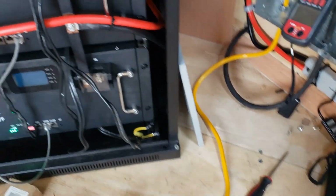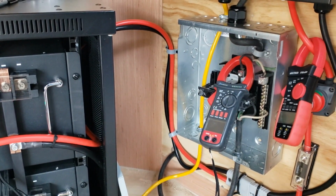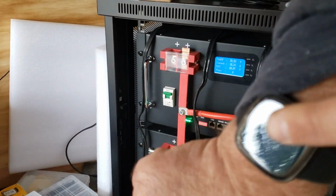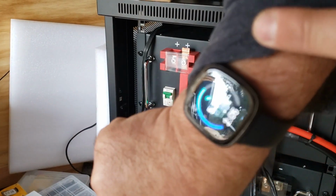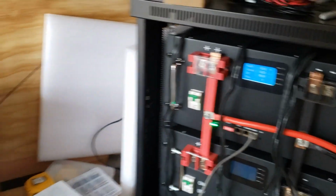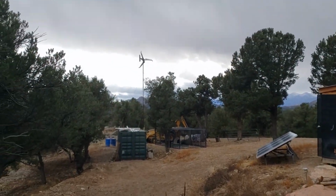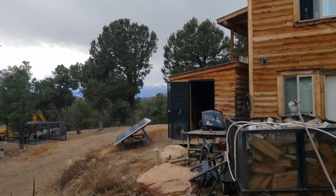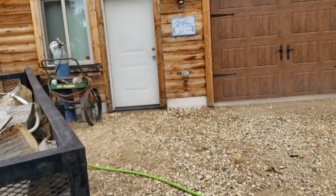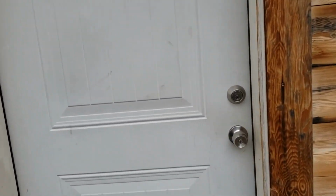Let's do a final temperature check. We're at like 1100 gallons. I just went and looked at the water, we're almost full. 58 degrees and it's 44 ambient. That's gotten up to 105 for a second. 93. The red one right here, the short one, I gotta check this connection because 172, that shouldn't be that hot. If you check right down here, same wire, 84.